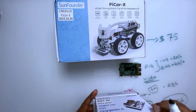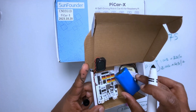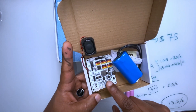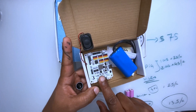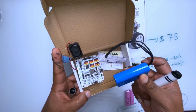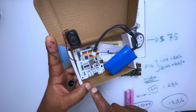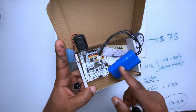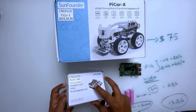There's another option called the Robot Hat from SunFounder — they have a version 4 with a battery charger included. The good thing about this is you can charge it with your Raspberry Pi charger. I'm going to create a separate video about the Robot Hat. You have the batteries and you can also charge with your Raspberry Pi 4 charger — once you plug it in it will automatically charge your battery, and you can still use it while charging. It's pretty cool.